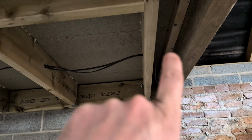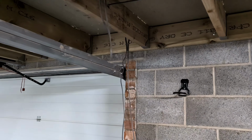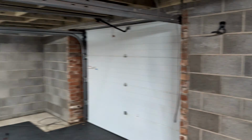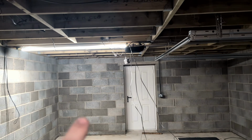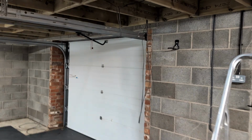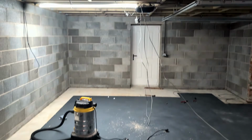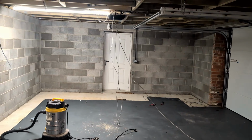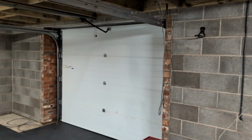So what I've done is I've gone through the beams. I've run the wiring for the lights. Because it was dark last night when I was doing this, I didn't want to isolate the lighting, so that's a job for later today. The plan is I'm going to add some downlights in, because that single batten struggles a little bit. I don't know if it comes across on camera, but it's always dark over here. So add some more lights, and then I'll be moving the light switch.